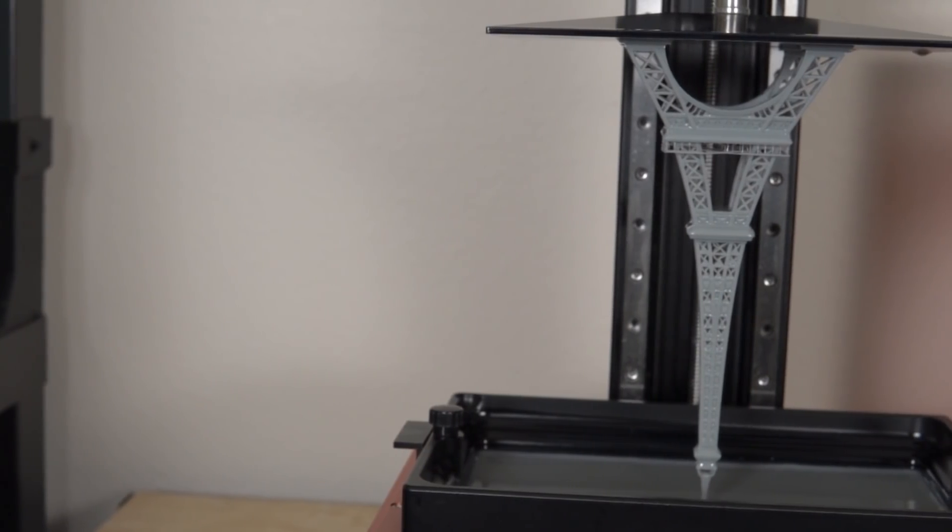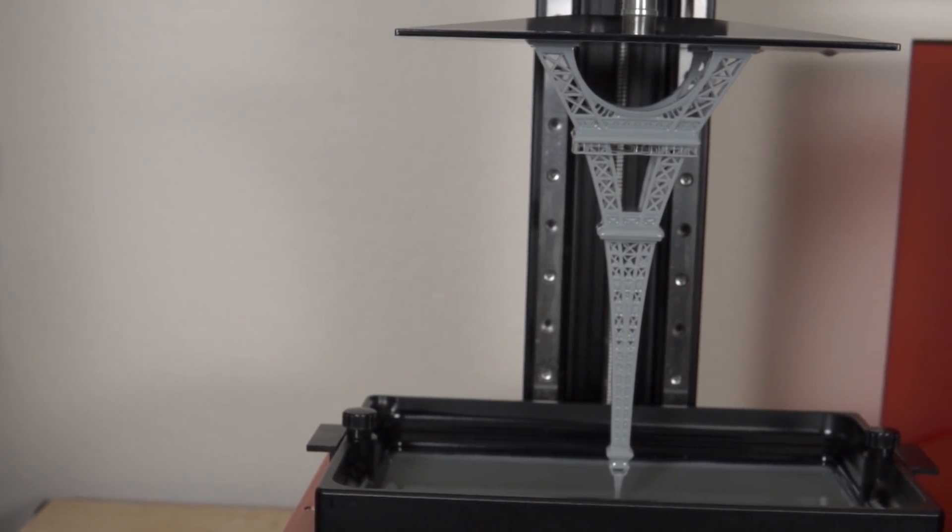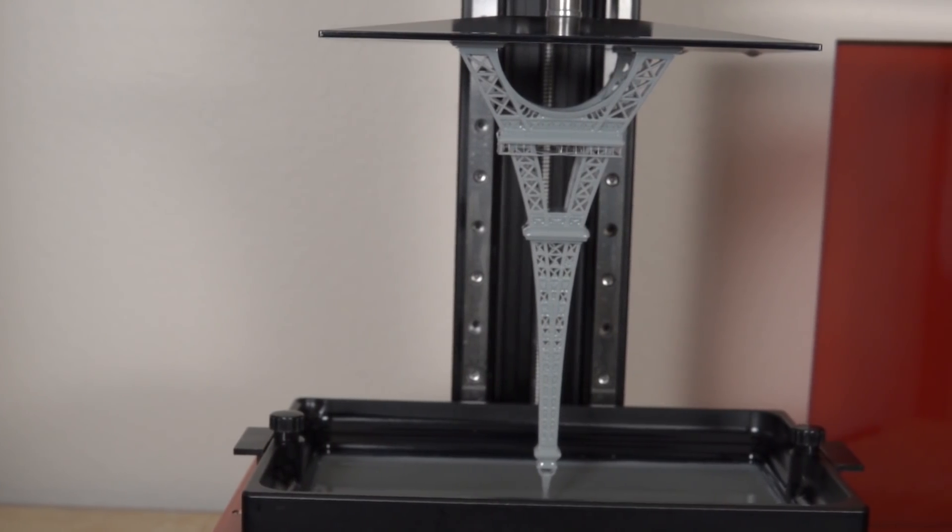I also wanted to print the Eiffel Tower, which I had previously printed on the Elegoo Mars, but this time scaled up much larger on the Elegoo Saturn — I dragged in the model, scaled it to max capacity, and hit print. All the prints I sliced were at 100-micron layer height, which has been my standard for resin 3D printing — a good middle ground for high quality without taking an eternity. The Eiffel Tower turned out really, really nicely. About halfway up there's a little railing that does have some obvious sag on a couple of parts, but I had the exact same issue on the Elegoo Mars, so I think that's a model issue rather than a printer issue.